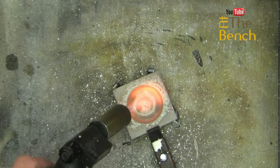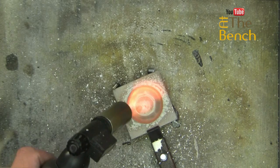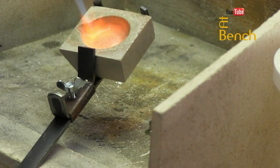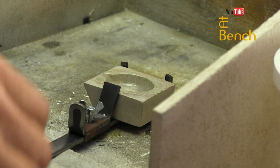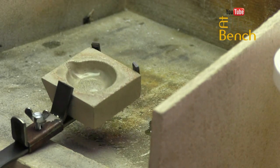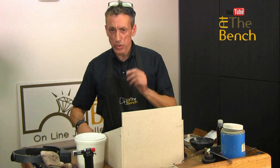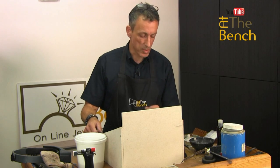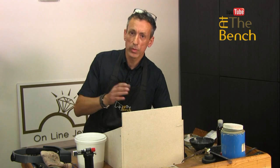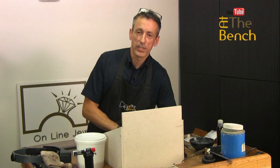We've heated up this crucible nicely, got a lovely glow about it, and glazed the inside completely with borax. You can see the shine all around the inside of that crucible, even around the outside edge of the lip — absolutely spot on and ready to use when we come to melt our silver or gold. We'll get a lovely smooth pour into the delft clay when casting, or the cuttlefish, or an ingot mould to put through the rolling mill, or hammer flat into sheet, wire, D-section, whatever you want. Remember to have a different crucible for each precious metal and each colour, so you don't get any contamination. That is how easy it is to prepare a crucible ready for melting your silver and gold down.